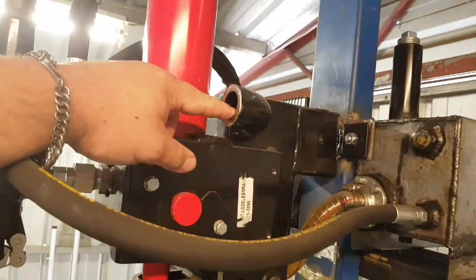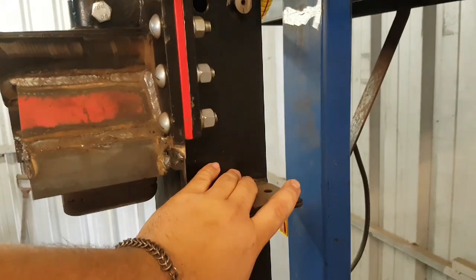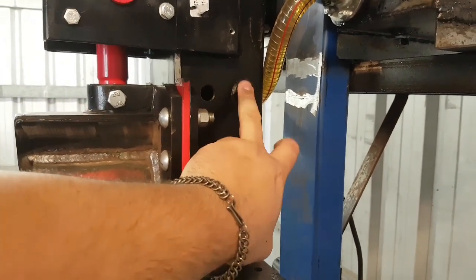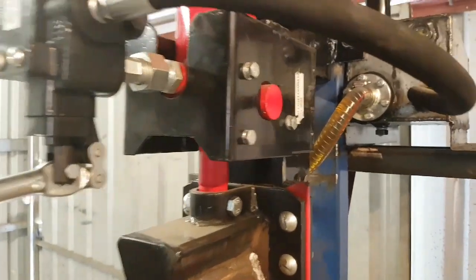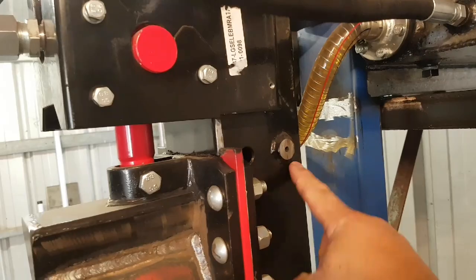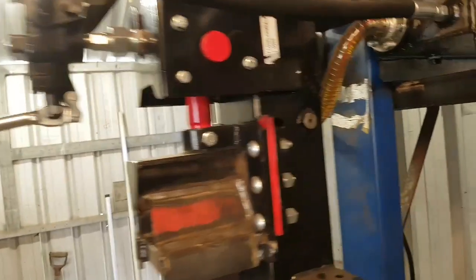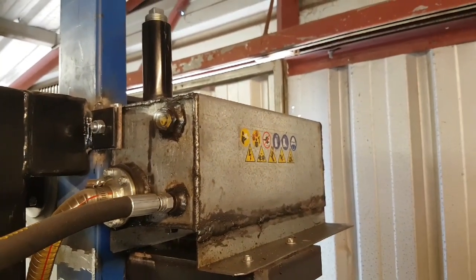You'll notice here at the spigot — this was the old tank. The actual mainframe here is the tank. There's the old bleed nozzle and refeed. We had to cut all that off because that's where the feed comes from, and it's at the top of your tank if it's working in the vertical position. So in order to make it work vertically, we had to build our own hydraulic tank.